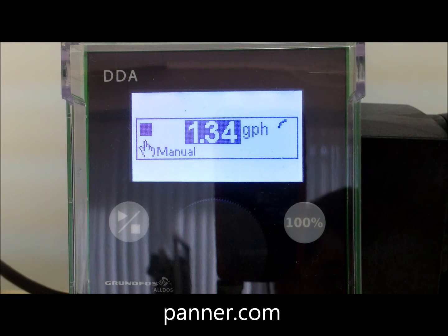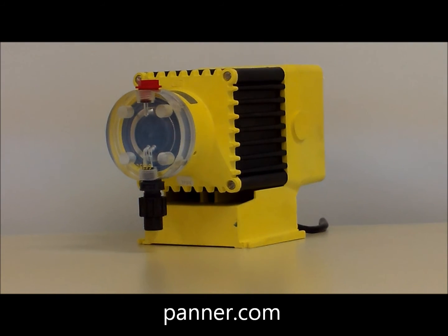The smart digital pump uses a variable speed stepper motor for smooth, quiet, and accurate dosing. Typical dosing pumps in industry use solenoids to activate a diaphragm. The suction and discharge strokes of solenoid-driven pumps are noisy, create system vibration, and create large pressure pulses of fluid, which take away from their accuracy.